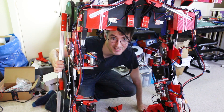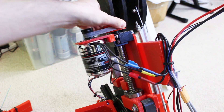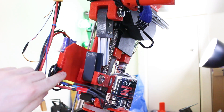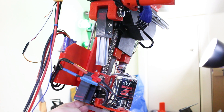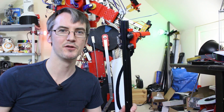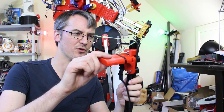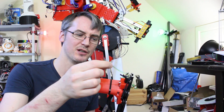Some of the pieces were plastic and probably weren't strong enough, which had an influence. I had superglued 3D printed T5 pulleys onto the ball screw, which was great until some of them stopped gripping — that's why the legs bent and couldn't straighten, leaving the suit stuck. Also, the brackets holding the ball screw to the joint-pushing mechanism came out or slipped. The plastic is too soft and the nuts can't be tightened enough for sufficient grip — ideally some of these pieces should have been metal. A strap attachment piece also fell off, pulling its screw out of the wood and ripping the wires off as well. That likely caused a foot to get stuck in front of the other with no hall effect input, making the legs go crooked and causing me to fall over backwards. The arms are still working though.